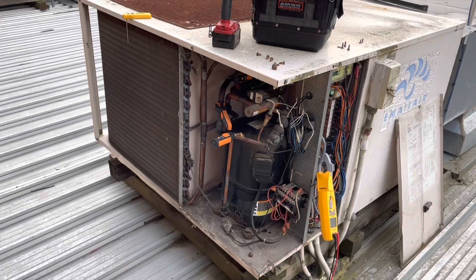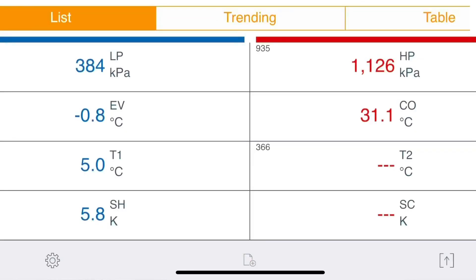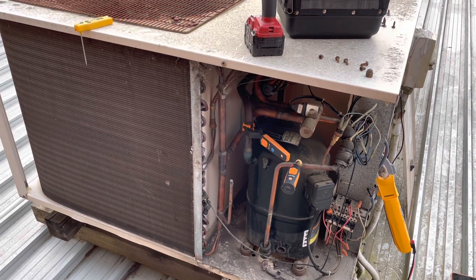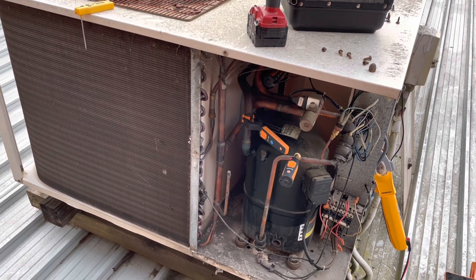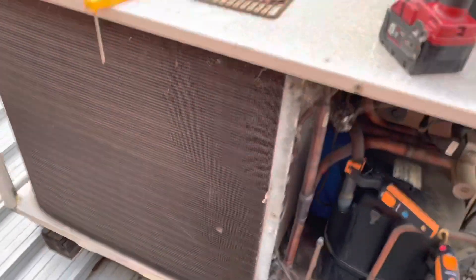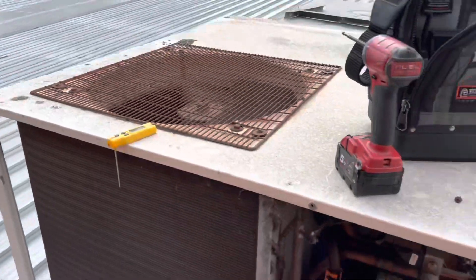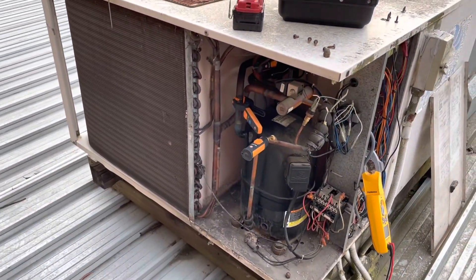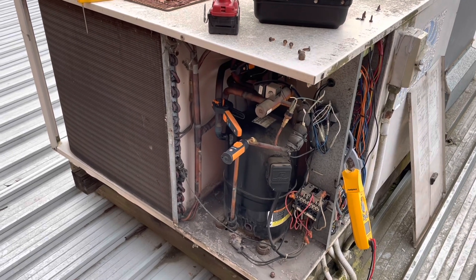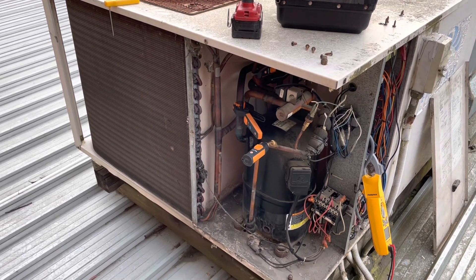This thing's been running for about 15 to 20 minutes now and my pressures are looking pretty good. I'm running a negative suction pressure, which on an air conditioner you don't normally want, but I'm running this thing outside its envelope anyway — it's 16 degrees down in the space, they're not going to be requiring cooling. My condensing temp's pretty good, 15 K diff, and it's 15 or 16 degrees outside. I'm leaning towards just a faulty switch, but they don't usually fail by themselves. This thing's pretty old and it's running on R22, so we'll keep monitoring.